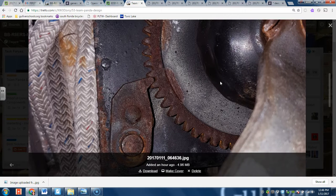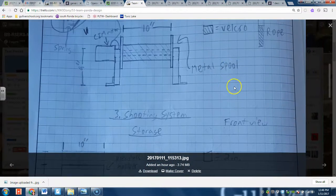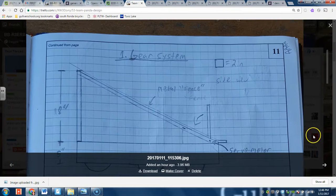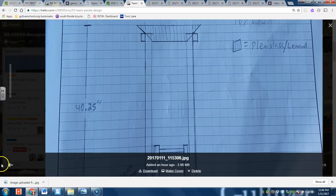That's exactly what we're thinking — just a strong piece of metal that latches on into a gear. It's also bracketed down to the center of the robot, right in the center. Since the gear system is all open, you can actually put this right in the center of the robot with nothing in the way. The rope can just pass over, you reel it up, and you can start lifting the robot from the center with no tilting when it's going up.